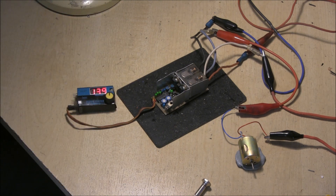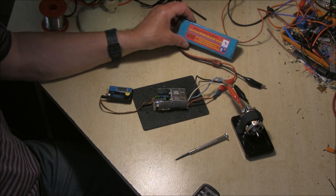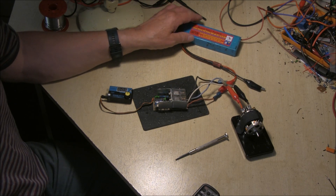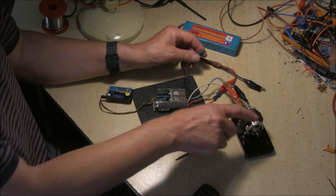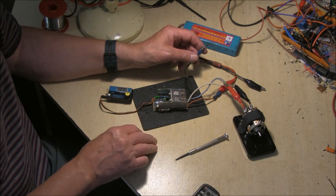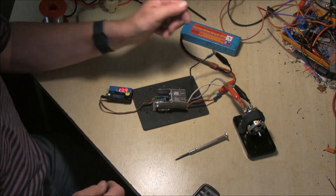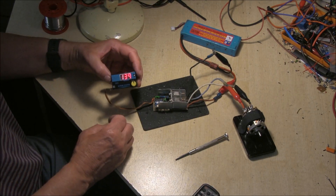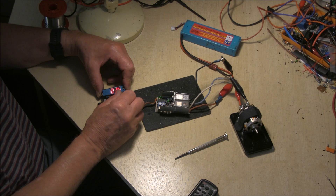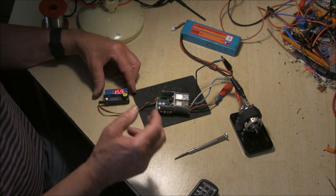With a proper NiCad or LiPo we'll be able to test it at full power. Here's an old Demon LiPo — 5,000mAh 20C from some years ago, that'll do it. So make sure it's connected the right way. We've got the more powerful brush motor — the sort of motor you'd be using at the same time in the 80s. That really shifts, doesn't it. And in reverse — see the reverse relay dropping out. So it's working fine.